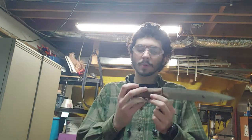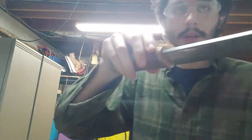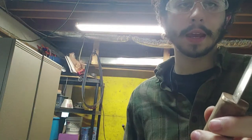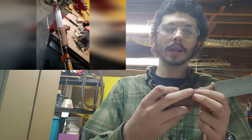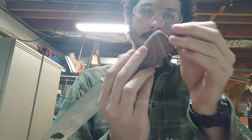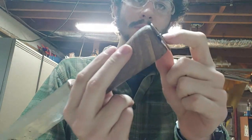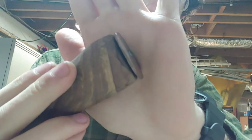Hi everyone, welcome to my humble little studio. I am a blacksmith. Today is episode 3 of my Viking sax build. So I glued it up, I did a little bit more fine-tuning on the bolster — you can see a nice transition after glue-up. I am going to peen the tang: I have my little back plate, I have my tang, and I'm going to push that on, hammer that on, and basically make a rivet with that right there.